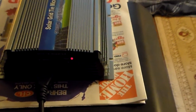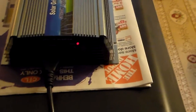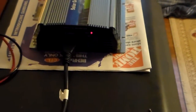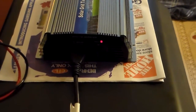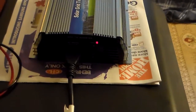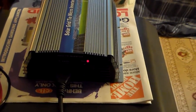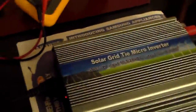You can leave it like this for half an hour or whatever. What's going to happen is eventually the fan will kick on to start cooling it. It's trying to do something, but it's not working. If we unplug this from the power meter, it shuts off like normal — the islanding protection. We'll plug it in direct just to show that it's not the meter that's causing the problem. The meter isn't causing the problem. And that's all it does — it flickers back and forth between normal and fault. The manual doesn't say anything about that kind of action. Nothing in the troubleshooting to address it flickering back and forth.